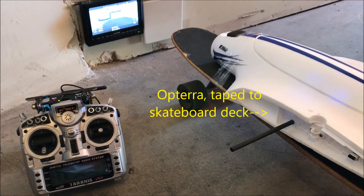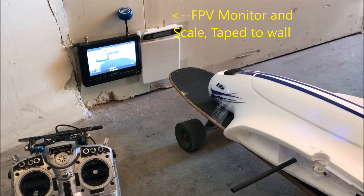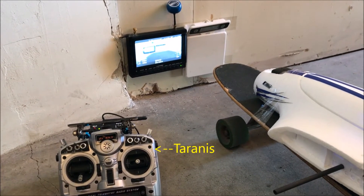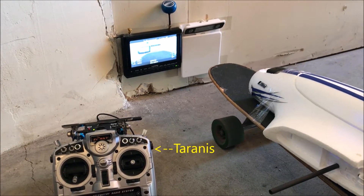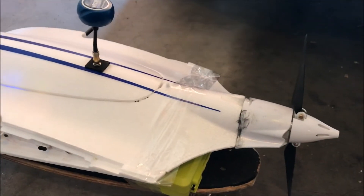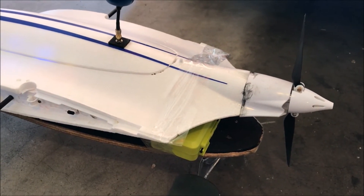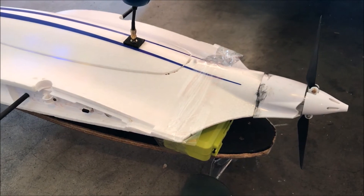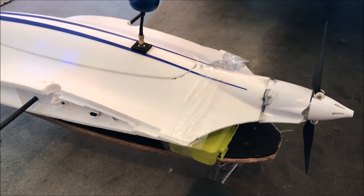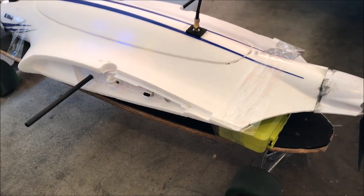In true San Diego fashion, what I've got set up here is a scale taped to the wall — that's going to give me my thrust numbers. Quite a few assumptions made here, a little bit about that later. I've got a monitor there which is going to tell me my amp and my voltage. We're using that 3S battery. Got my radio. Got my 10-inch prop on there currently, and I'll pull that off and put on a 14x9.5 as well as a 13x7. I'll put more of that down below in the description.